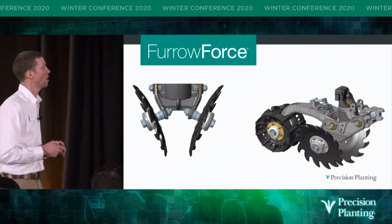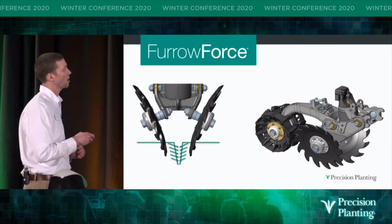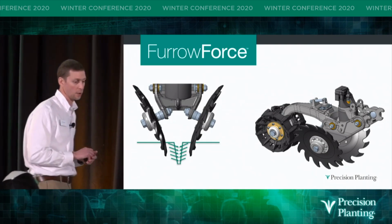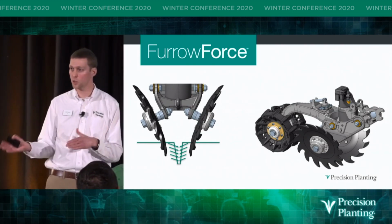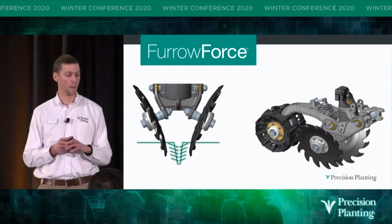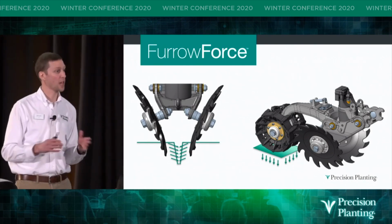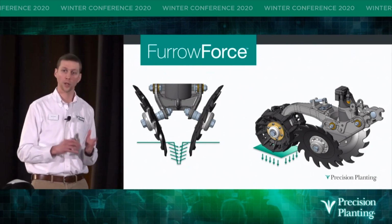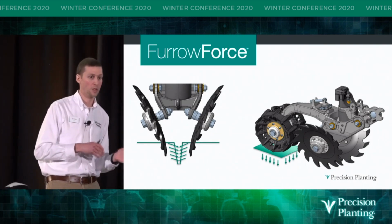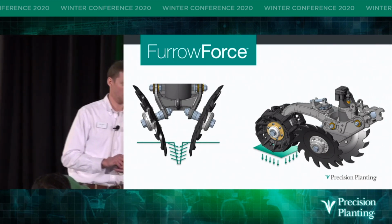So the first stage is our notch wheels. And they're set pretty aggressively so that the closest point between those notch wheels is at the bottom. So we've seen with 2-stage closing systems, it's still important to close from the bottom of the seed trench up. The second stage are our stitch wheels. So those have some closing action to them as well, but they also act like a gauge wheel for the first stage notch wheels. They limit the depth that the notch wheels can penetrate the soil. So it sounds a lot like our gauge wheels for our opening disc, right?